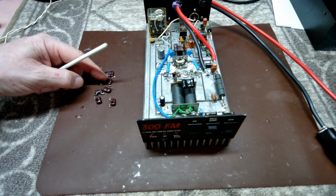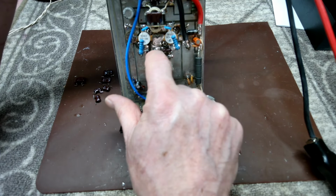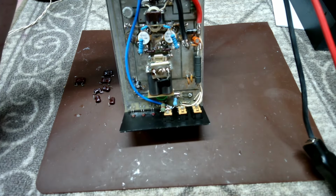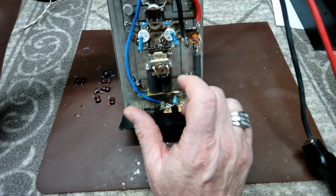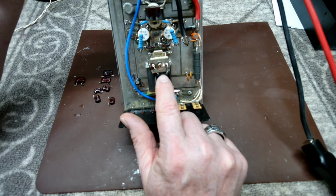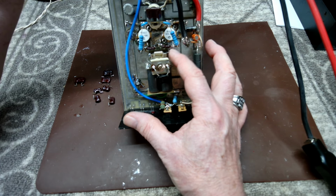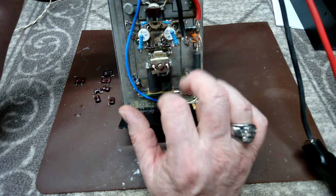But I went ahead and pulled those out and replaced those with a metal clad. Get this tilted up here a little bit. So you're going to see we replaced the metal clad here, and where they had two here and two here, we replaced those with singles, and I actually bumped these up just a little bit more on the capacitance. The way this thing is designed and built, most all the tuning for the output is done on the output transformer. So I left this tuner, had to change out this capacitor here and move it up about 120 pF extra. So we added 120 here and almost another 180 pF here by the time we moved up to a metal clad, in order to give myself a little bit of room to tune. This way I could tweak this a little bit and get it fine-tuned in.